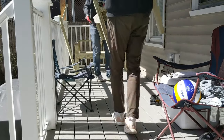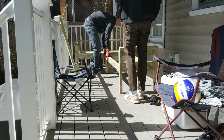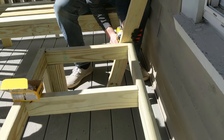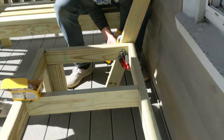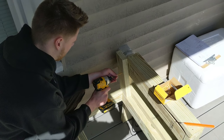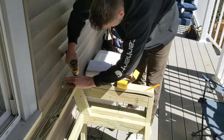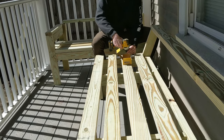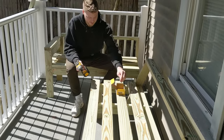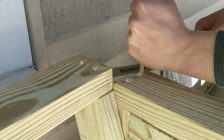I brought the couch sections up to where they would be positioned. Then I did a rough field measurement on the angle I wanted the backrest to sit, along with the length of that piece. The angle would be cut at the bottom of the leg and at the top, so that the couch remains flat on the ground and the long stretcher can span across to connect at the other end. A short piece with the same angles will be needed at this connection. Pre-cut pieces were used as the planks running laterally across the seat framing, spaced an inch and a half apart — these will hold the cushions. All these planks needed to be screwed in place after pre-positioning them. To fill in all exposed pre-drilled holes I used 3/8-inch dowels with wood glue, then I used a flush saw to remove the excess.